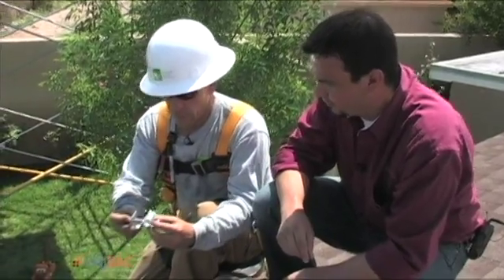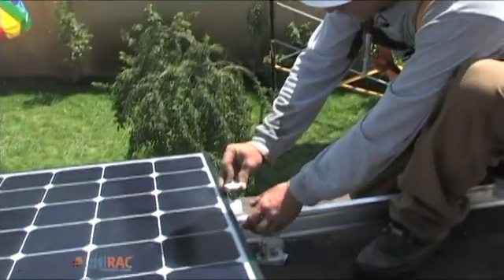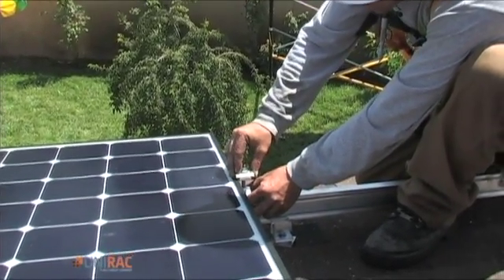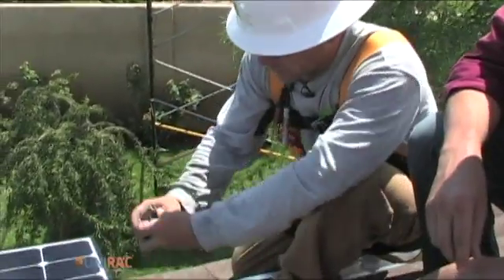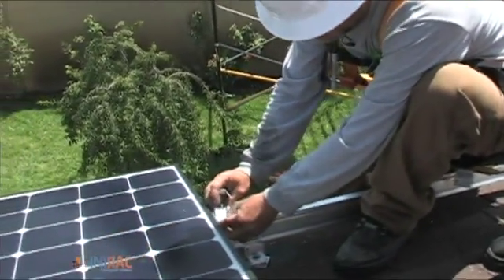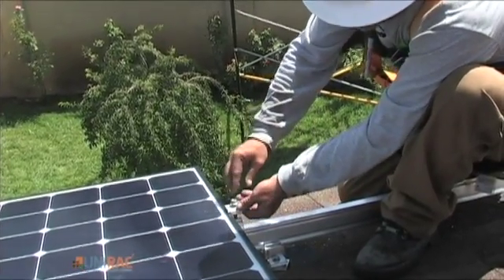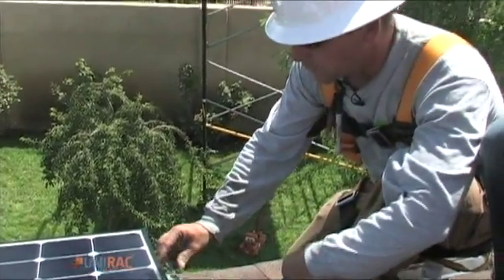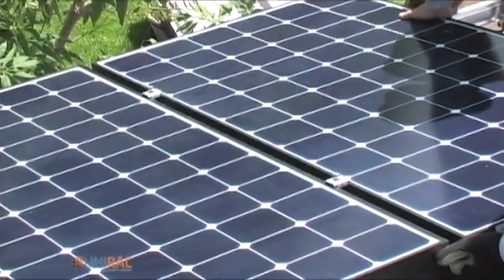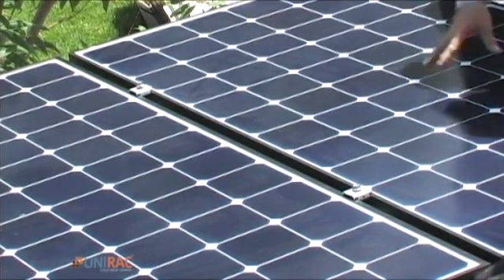Could you tell us a little bit how you connect your solar modules together? We use this device called a mid clamp and it latches on to the rail system and it's got sharp teeth on it, so it digs into the panel and gets a really good hold. It snaps on like that, sets on top of there, and then you slide your other panel underneath, and when you tighten this down it holds both panels — sort of like these over here are doing. And at the same time it's also creating your electrical bond between your panels.